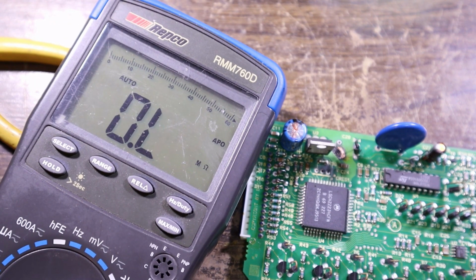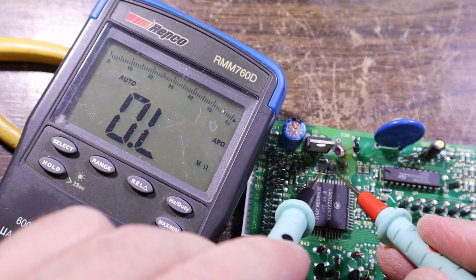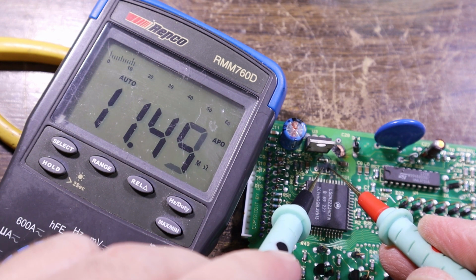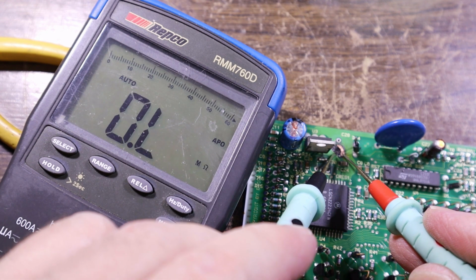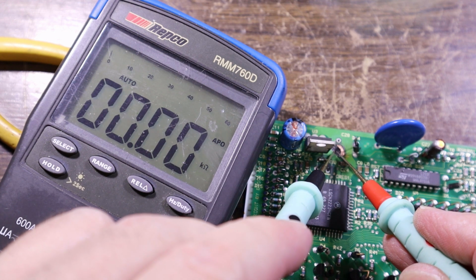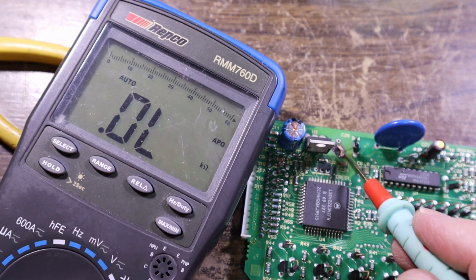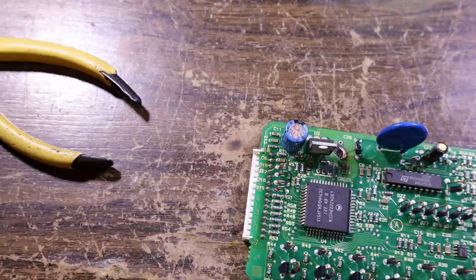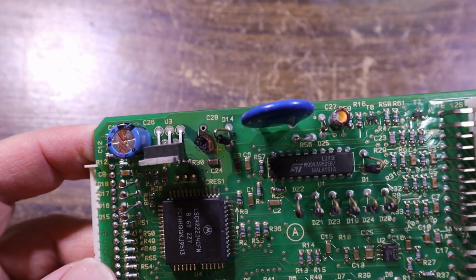Let's see if that carbon is conductive. Oh, maybe we washed it away too much. Oh no, there we go. Look at that. There would have been more before we were washing at it, so that would have most definitely been interfering with the clock signal. And then if we probe around in the burnt section, yeah, it's down around 130 ohms. This has to go. We have to chop it all out, like the cavity version of a dentist in the electronic world.